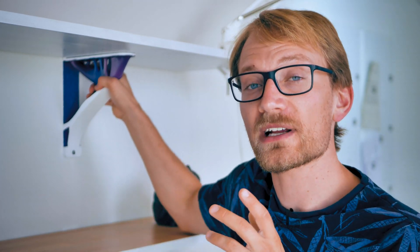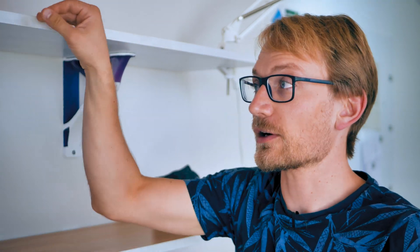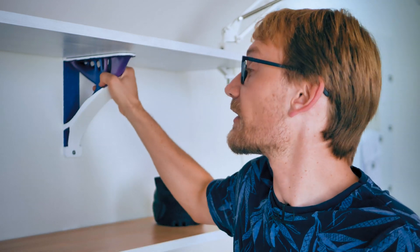If it were 30–35 degrees maybe I'd be worrying, but it rarely gets over 26–27 degrees, because I'll be sweating in here. And the other thing is, relative to what they can handle, these braces aren't loaded all that much. I know I can stand on these, but I've not broken one, so I don't actually know how much they can take — but they can easily take over 80kg each. So you can take a 160kg person and lay them on top of each of these shelves and it wouldn't fail. I'm pretty comfortable with that. I think these parts are gonna be fine, and in case they do warp or sag over time I will let you know, but I don't expect that to happen at all.